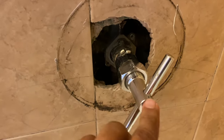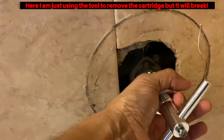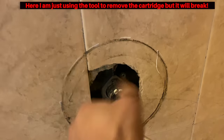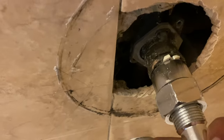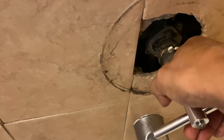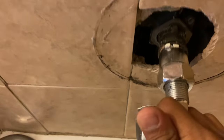In this video I have a plastic cartridge and I did not have to use any drilling method. I just used a simple tool initially to remove it. I'll be showing how it broke and what methods I used to remove the entire cartridge. Here you can see I have the tool installed and once I tightened the back side, I was using the method that came with it. You can see the cartridge is kind of pulling out as I'm unscrewing it — apologies for the camera shake, it was hard to film with one hand.